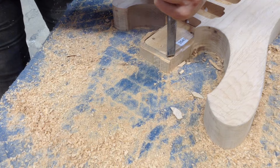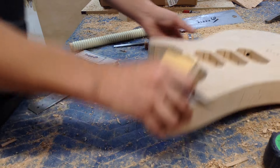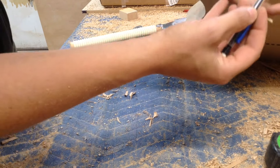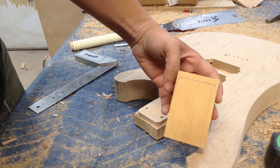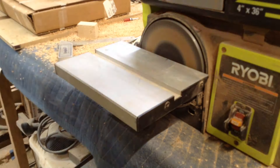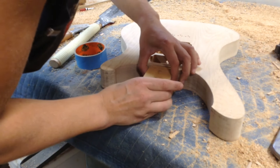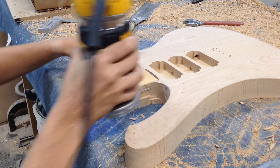I'm removing some of this material — I made a pencil line to follow and I'm creating a little ledge so I could take this piece of three-quarter inch plywood. That neck part tapers, so I cut this so it's the perfect width to fit in the back and then trace that taper with a pencil using that ledge I created. It's just a little bit of material to remove, so I cut it down to my line and then used some sanding materials to clean up that curve. Then I could slide it into place, and now that patterning bit can follow this blank without cutting into that recess.